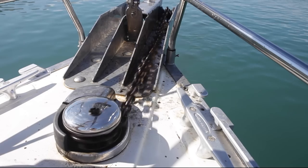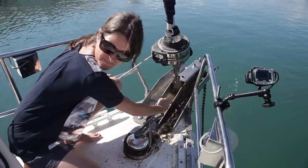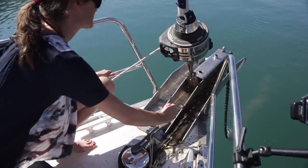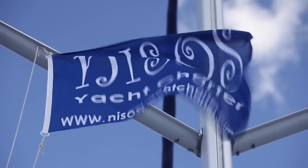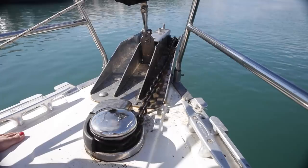Once you have the lines doubled up, you may want to tighten the anchor chain a little. At Nissos, they prefer to lower the anchor in manual mode, using the clutch to control the speed of the drop. With strong crosswinds, you may want to approach the quay a little bit faster, and the electric windlass may struggle to keep up.